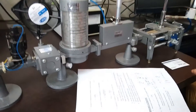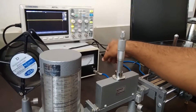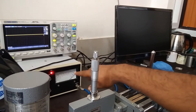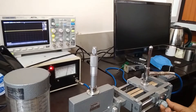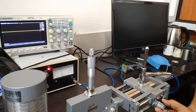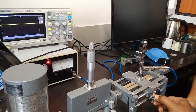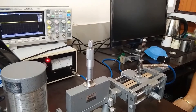The next objective is to calculate the VSWR. I connected the output probe to the VSWR meter and replaced the short circuit with a termination on the slotted section. We first set the VSWR meter reading to 1. When moving the slotted section, the meter moves upward. When it reaches the maximum position and then moves back, that position corresponds to the VSWR of the standing wave generated. From the VSWR meter we can take the reading.